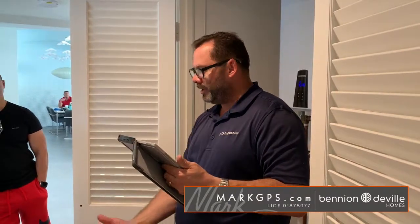The pool filter is leaking slightly from the drain plug at the base of the unit. The pool structure also has some chipped and stained surface on the plaster. The equipment leak is just a drain plug — it might need a new seal or it was cross-threaded when put back in. It's just a slight little drip, but it's wasting money.